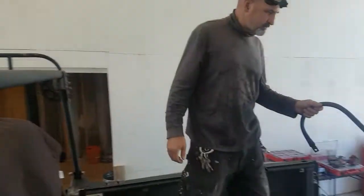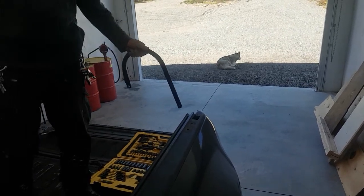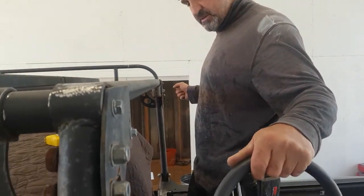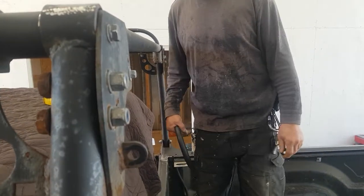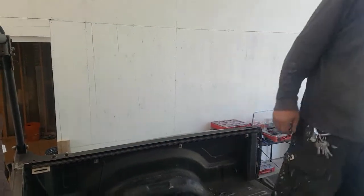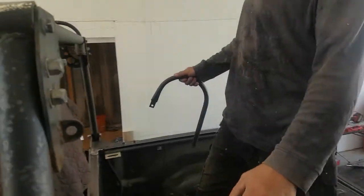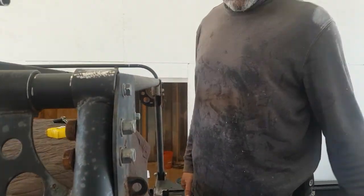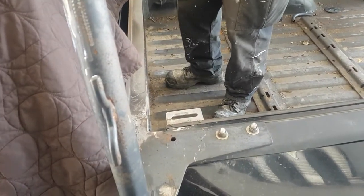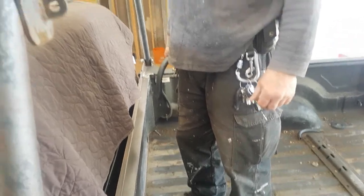At the back here I have a piece of metal welded up — another part of the rack. Next video I'll show that properly. I have a rack that goes on here and I take it off and move it up here. I need to design a way to mount it so it sits nicely. Maybe I'll figure a way to stack it here — put a screw in it, get another tab for the other side and match it up exactly. The only thing is I have a plate that sits on here with a square that goes down, so I'm thinking I'll cut that off. Maybe make a couple little plates so it fits and sits there — like a peg that sits right in. That way it stops it from rattling once you tighten it up.